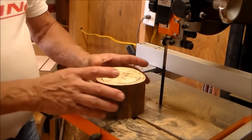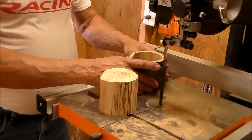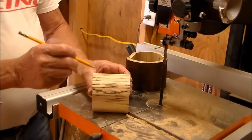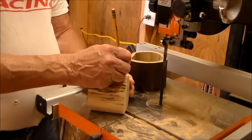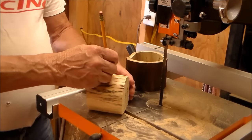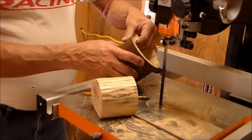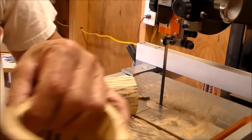Now this is very brittle — it's probably going to break in a couple of spots, so it's just a matter of gluing it up. This wood's pretty old. Next thing, we've got to cut this — this is the front, the back's on here. I'm going to make sure I mark this so I can see it: F and B. Because when we cut the front and the back off you want to be able to know which way is which. This is very delicate old wood — it's got a little crack, but I'll just put some glue in there when I glue this up and it'll hold it.